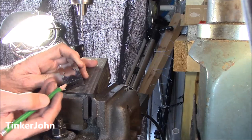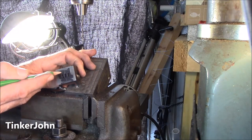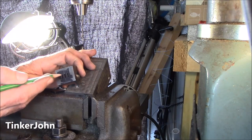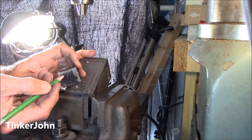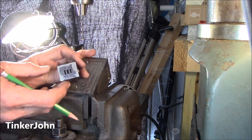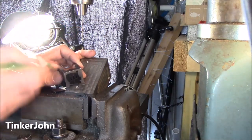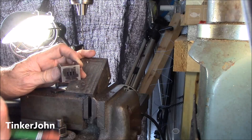There's one more operation to the cylinder, and it's just straightforward. I've got to have an inlet and an exhaust, and that's what this center port here is. I just need to come in and drill straight down to get to that port. That's just going to be a straight milling operation — I'm going to use the same number 33 bit and just drill down on each side.